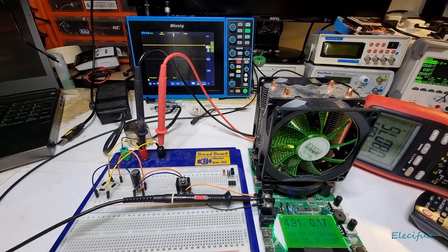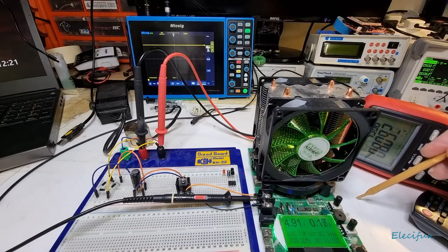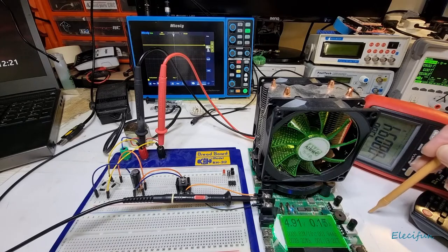You want a few volts of overhead. We're already losing voltage from the 10-volt supply because of two diodes in the path — we drop about 1.4 volts due to the forward voltage of 0.7 volts on each diode. We're only using two diodes at a time: when it's positive we use two diodes, and when it flips over we use the other two while those block.